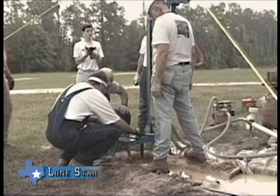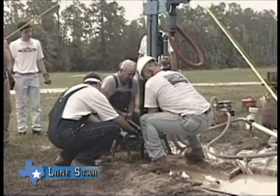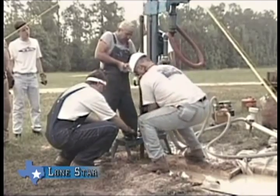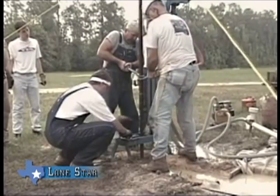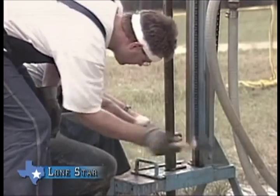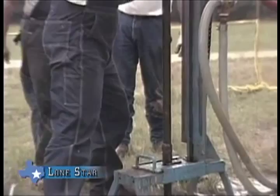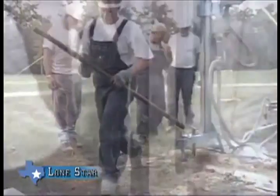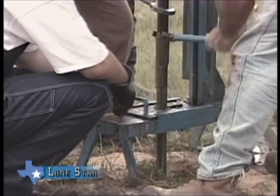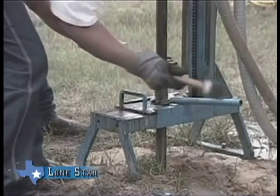This allows the pipe to be pulled unobstructed. The drill pipe is pulled with the use of two C-span wrenches that grip the pipe when lifted. The driller and his assistant stand on opposite sides of the LS 100 and lift the pipe together. At the top of the lift, the person holding the top wrench holds while the person on the bottom wrench slides his C-wrench down, then holds while the person on the top wrench slides his down. The C-wrenches should not be removed from the pipe and the slips should stay engaged except for passing a tool joint — a mistake at this point could result in dropping the drill pipe down the borehole. C-span wrenches should be placed beneath the tool joints and rested on the slips while the joint is being unthreaded; if the joint is extremely tight, a sharp wrap with the rig hammer will loosen it.